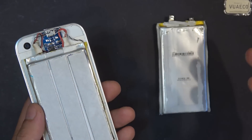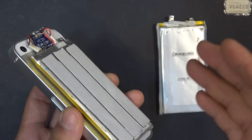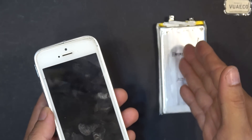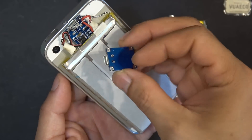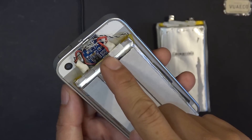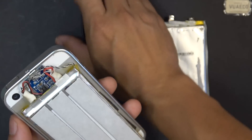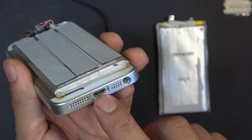It's a long story so I'll talk about that in a separate video. I went ahead and replaced it with a new battery, and I was thinking if I can find a different way to charge my battery without having to plug into the phone, because it's intentionally made to overcharge my battery. So I went ahead and installed this TP4056 board. It's pretty small so it can fit on my phone very easily, and it's made for charging lithium-ion batteries. I soldered it directly onto the battery terminal so I can plug it into a USB power device to charge my battery without using the phone's original BMS.